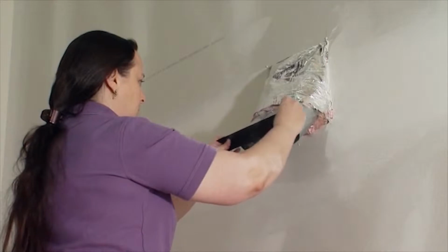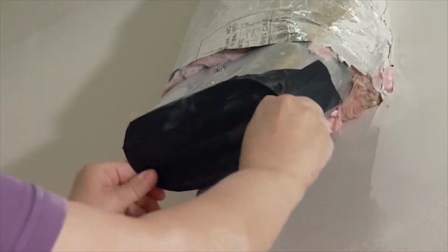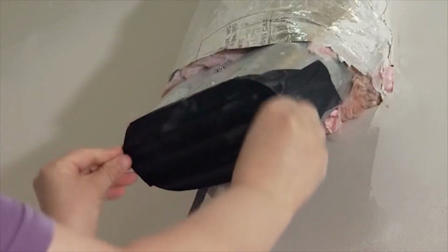We have a duct in the kitchen where the exhaust fan will eventually go that's still open to the outside, so we'll go ahead and take care of that. Yeah, we definitely got to seal that up. Anything else for prep? No, it looks like it's going to be an intermediate blower door test because we definitely don't have the finished product, like the paint, the trim, the outlet covers, and the hardware. So the reading is going to be pretty close to where the finished product might be. I think you're right. We may find just a couple little things that may help tighten up the envelope for the builder. Absolutely. All right, shall we get started? Sure. Great.